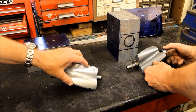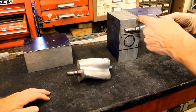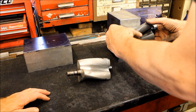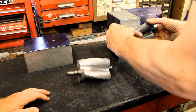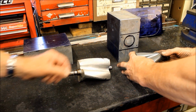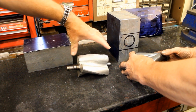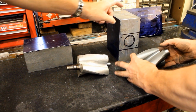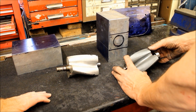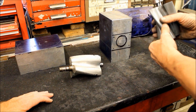Okay, so you're saying that this is going to be used as some kind of test piece. What I've got is these are just over 4 inches, and the block's 90mm. So I need to remove 10mm off the length. Oh right, okay. So how hard are these things? Is it easy to machine them down? You can file them. They're not hard at all. So you'll take this down from about 4 inches to 90mm. Well, we need to remove possibly about 3/8 to 1/2 inch off the width that we don't need.